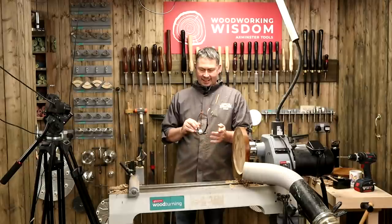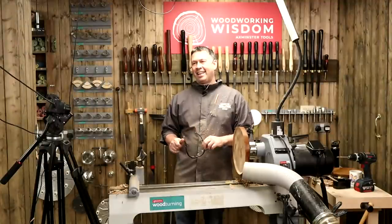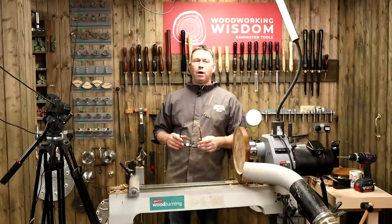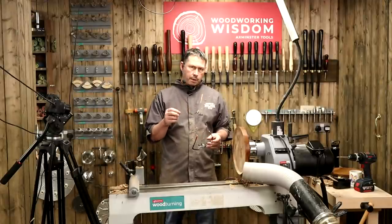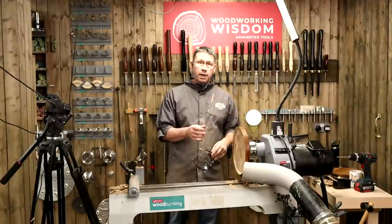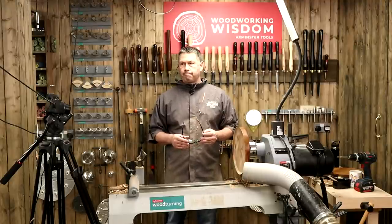With the spirit stains, so this from James, with the spirit stains, do you put spray sanding sealer on after the stain before the spray lacquer or is it not needed? No, what I would do, if you're going to put a spirit stain on, if you can wet sand the last couple of stages, just spray with a little bit of water just to raise the grain, then put your spirit stain on, then lacquer over the top of that. I would personally, again, that's what I would go with.